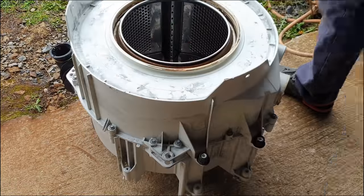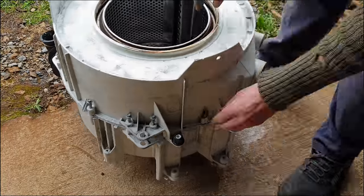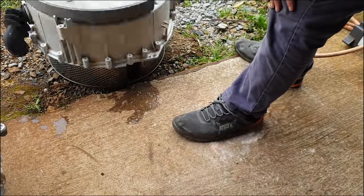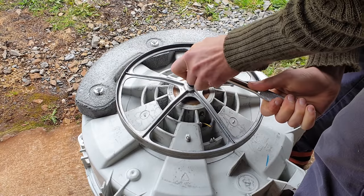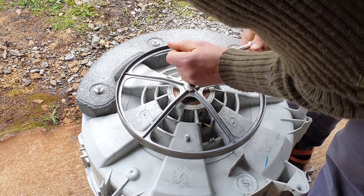One of the problems with reusing motors like these is that if you plug them straight up to the mains, they screech away at a ridiculous RPM and the centrifugal forces can in fact tear the motor apart. For this project we're going to use closed loop speed control based around an Arduino, and there'll be plenty more on that later.